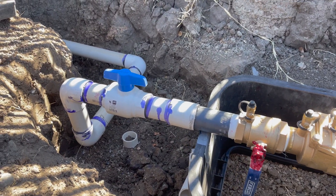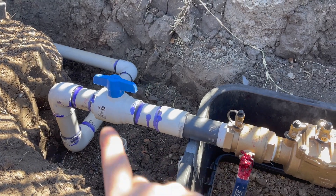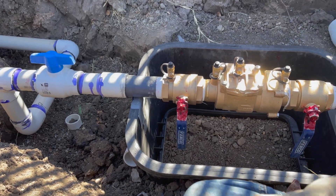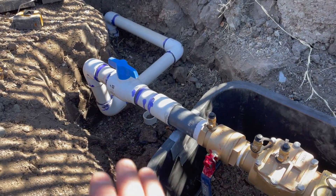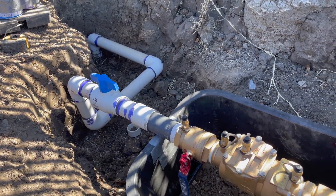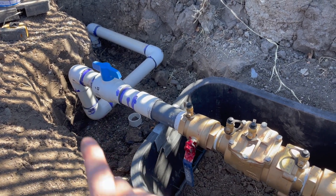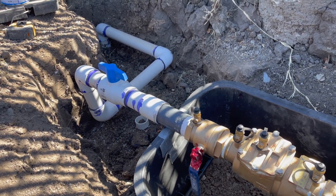One of the things that's still the same is you see I've got a ball valve as my shut-off valve before the double check. This is something you're going to want to make sure you always do regardless — the rules say you have to have that. In a situation like this where we're coming straight off a water meter, it has a shut-off valve before the meter, we come out and go into our backflow, but we've got our other shut-off valve right before that backflow device.